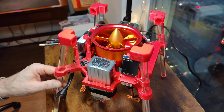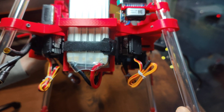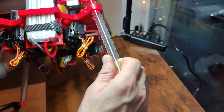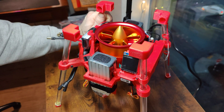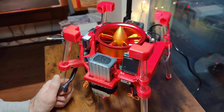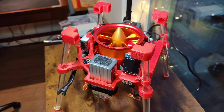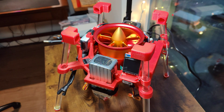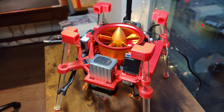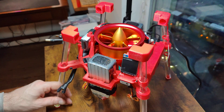On the bottom side of this same unit is the TF-Luna LiDAR module. It's quite tiny, with a listed range of 0.2 meters — 20 centimeters — up to 8 meters. This is actually only 17 centimeters off the ground, but I've seen video online of them working down to 13, so I wasn't too worried about it. This is just a test article so it can be changed if needed, but this will obviously be for altitude information.